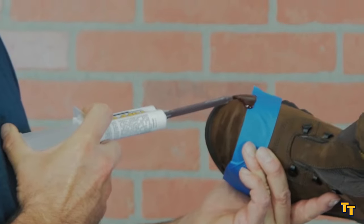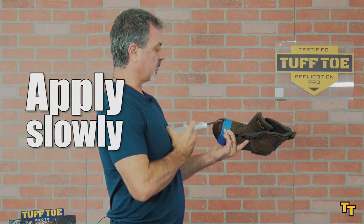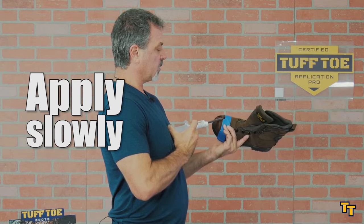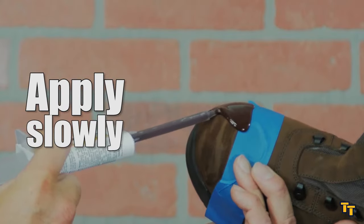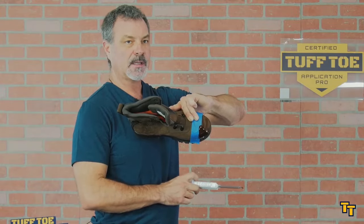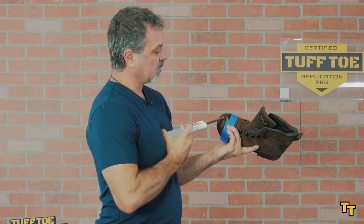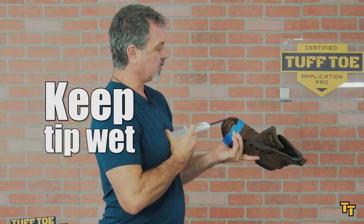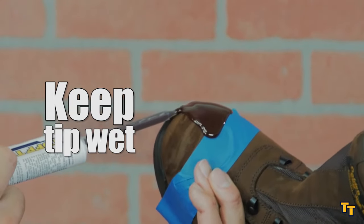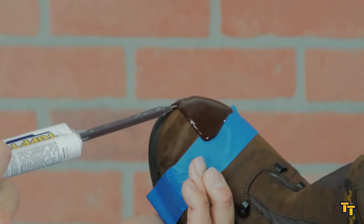As I said, the tough gun really makes this super easy. But as you can see, I'm controlling the flow by going very slow with the material — I'm not squeezing it out way too fast. If it starts to run on you, just turn it over, let the material flow back into itself, and pick up where you left off. You also want to make sure you keep the tip wet — that just means you have the tip in the material as you dispense it. It's called keeping the tip wet. It avoids any cornrow effect and you'll get a nice, smooth, clean finish.